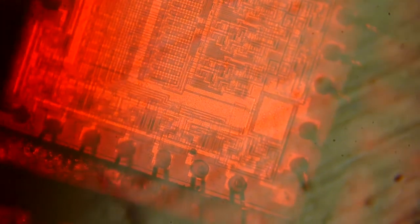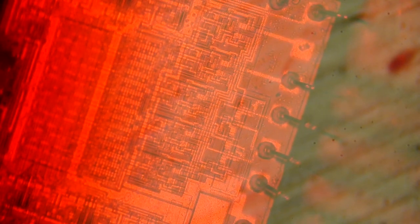Let's see if we can find the chip. The chip's in the back here — there it is. We can see some bond wires going to the chip and the traces of the chip. The bond wires go all the way around: only two bonds on that side, some bonds there, bonds along that edge. Looks like maybe one test pad, a second test pad, and then some others. And then some actual circuitry, which is basically just a ROM — a decoder ROM to turn on the right LEDs when the address goes from 0 to FF.